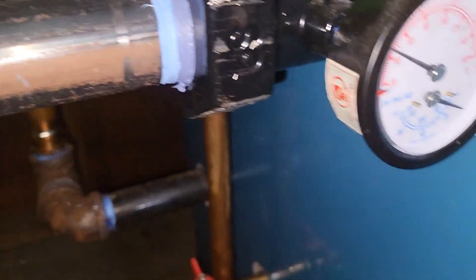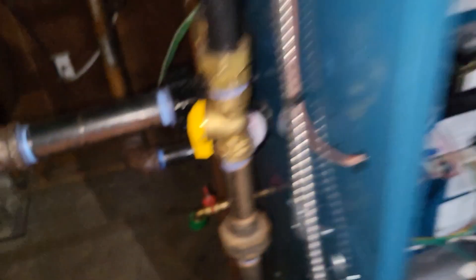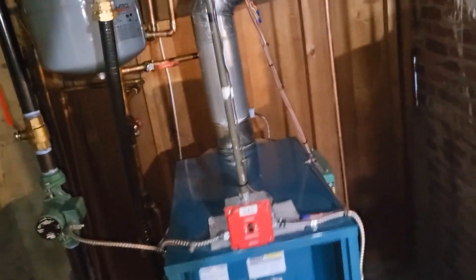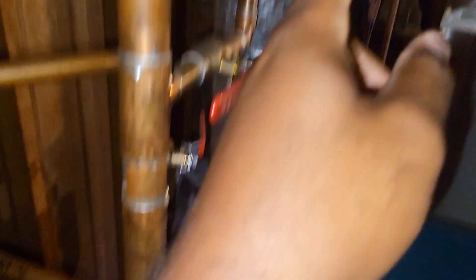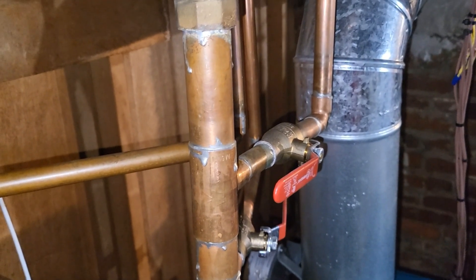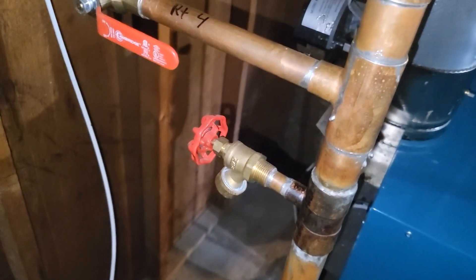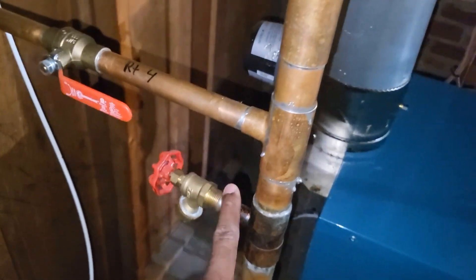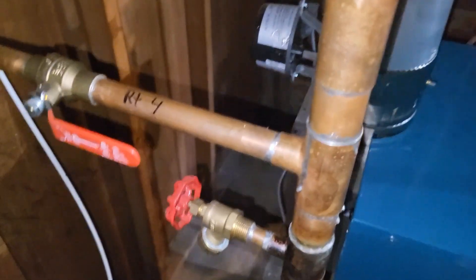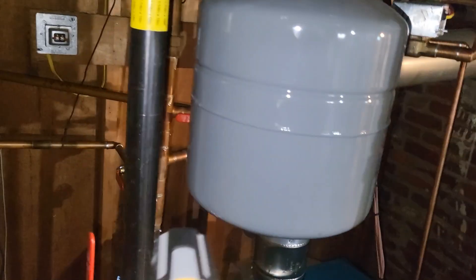About five minutes ago. Upstairs, this is a very interesting setup — they have zone valves with a drain here to bleed air from the boiler. However, on the top floor they have baseboards with bleeder keys on them. This drain valve at the boiler is a great way to drain air, but if you can, it's a lot quicker to just bleed air from the top of the system, granted if you have bleeder vents on the radiators and baseboards.